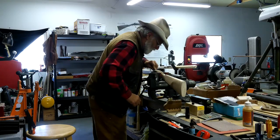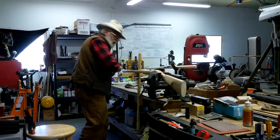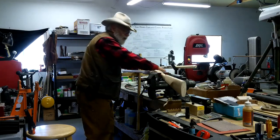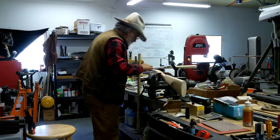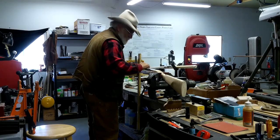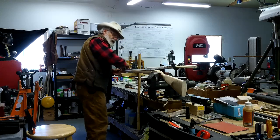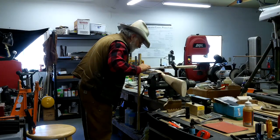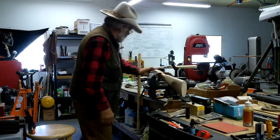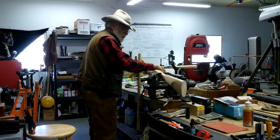I've got to make sure I take the housing flat down just a little so it'll sit right in there. It's almost just right — just a little more. I'm going to go to the 100 grit paper now. It's starting to go in and out really nicely. It just drops right in — a little tight on the flat, comes out easy. Get it started straight and it falls right in, all the way down. It's got to be straight though — there's a little knob over here. Falls in straight, goes right down. Probably just a little tight still, but a little more sanding and that'll be done.